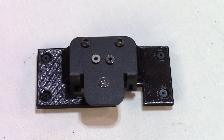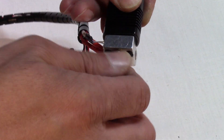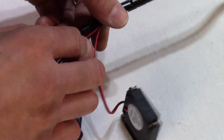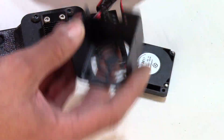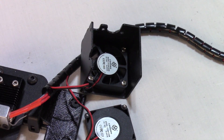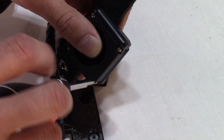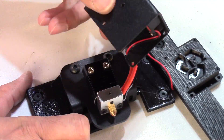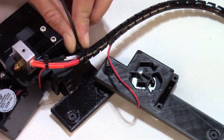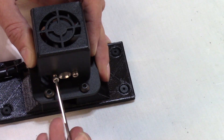Set the two screws into the heat sink and attach it to the head plate with washers in between, using size 3 hex tool. Screw the nozzle onto the heat block, making sure the wires are on the left side, using a wrench and/or pliers. Reattach the main fan to the shroud, making sure the wire side is facing down towards the base of the shroud, lining up where the heater and thermo wires sit — make sure the sticker side is facing towards the heat sink, using a Phillips screwdriver. Reattach the shroud using its original screws — it's good to add a zip tie to these three wires at the base of the shroud, using a size 2.5 hex tool. Using the original four screws, attach the parts cooling fan to the printed bracket — Recreator 3D Part 3 cooling fan plate — making sure the sticker side is facing up with the blower facing down, using a Phillips screwdriver.